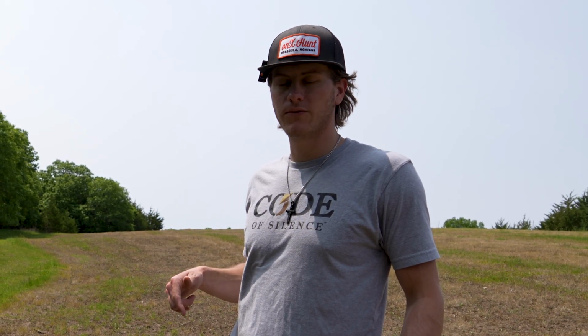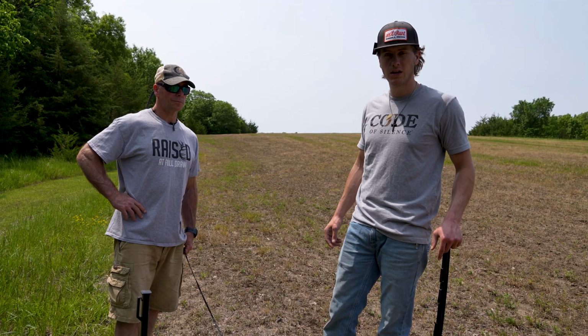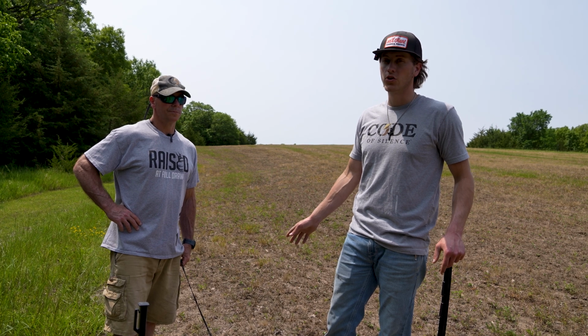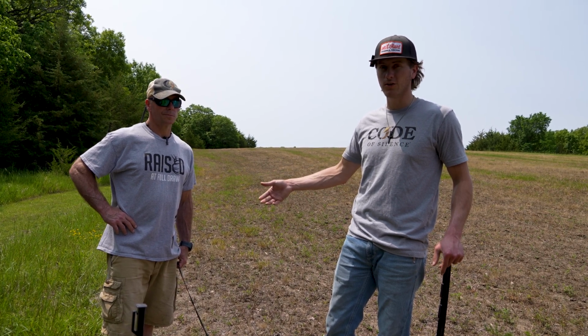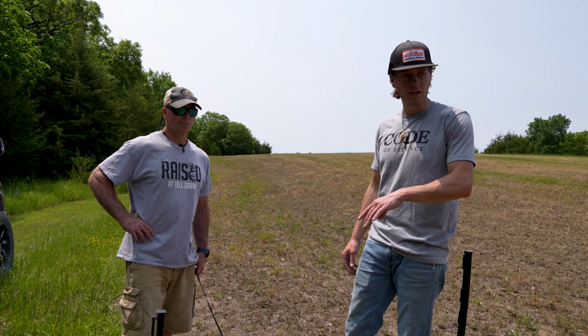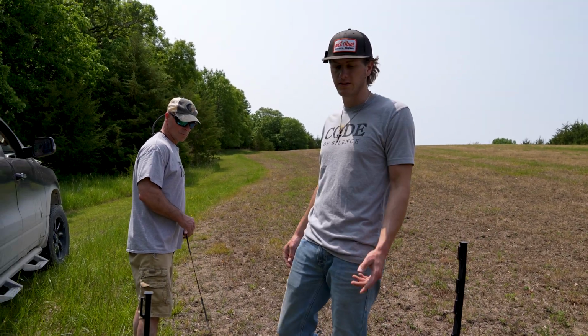One of the major reasons they're telling you need higher power is because most of these places that are doing electric fences for cattle pastures and things like that have weeds and things contacting the fence. So if you have a field and keep it pretty well maintained, like I'll come through and make sure, like this fence line right here, I'll mow it or weed eat it. If you don't have any contact of weeds or anything like that, you can get away with a lot less power, going from a $400 or $500 unit that's gonna power your fence down to like $180 to $200. So that's a really big tip. If it sounds stupid, but if you get your weeds and stuff cleared out from your fence, you're gonna save a lot more money on your solar panel and your fence itself.